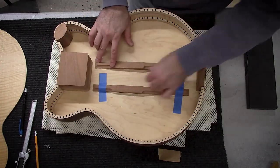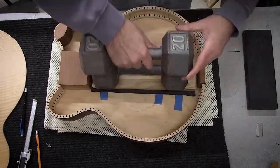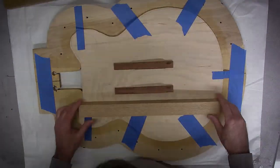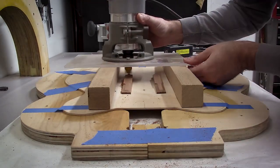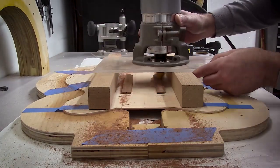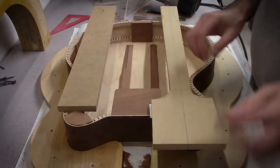Using a little tape to hold things in place while I figure out how I'm going to compress these — and it's always good to have some boat anchors laying around. With the ribs glued to the underside of the top and the back, I decided I needed to square them up to each other and make sure they're level across the two. That way when I glue that trestle between the top and the back, everything is going to be on the same plane. At least, that's what my brain is telling me.